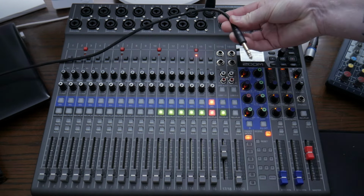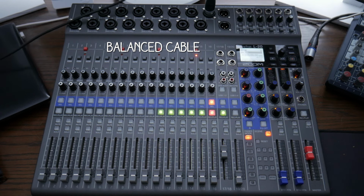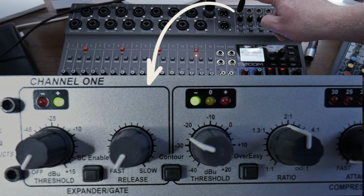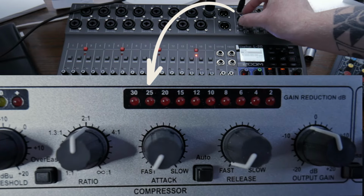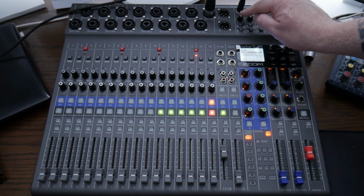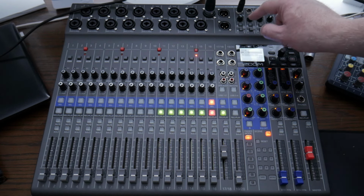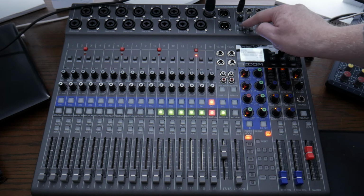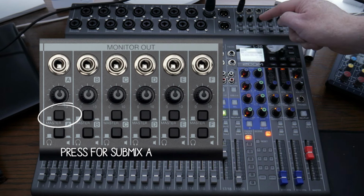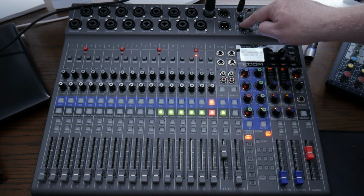I can now connect a TRS, or tip ring sleeve, jack, plug it directly into A, that is sending the direct vocal out to the rack compressor. I've found that having the output set to about 10 or 11 o'clock is absolutely ample amplitude. Anything much more than that and you're going to cause feedback. And you can choose whether or not you have the master mix or, depressed, it is mix A. So now we've got submix A going through there.